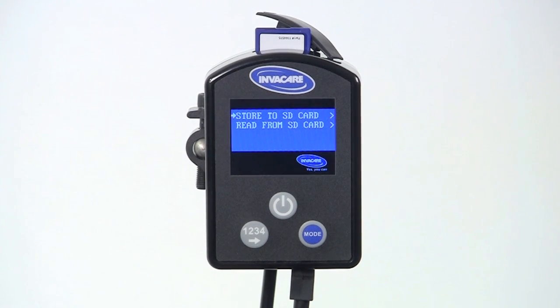To select Store 2, I will use the forward-reverse on my joystick, or up-down on my display, to highlight the selection. Once I have Store 2 card selected, to create my backup file, I give a write driver command, and then another write driver command to start storing. My system is backed up in just a few seconds. I'll turn the power off and remove my Basic Card.